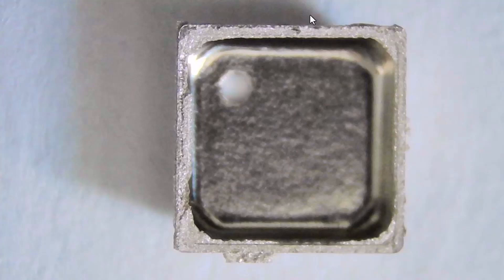Let's open up the can and look inside. Once we remove the top metal lid, we can see it's essentially an empty can - it serves primarily just to give top protection. It's sealed from outside with a bonding glue-type material which is reasonably strong and high-temperature-rated so it can survive the soldering process.